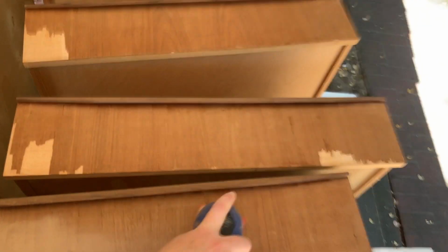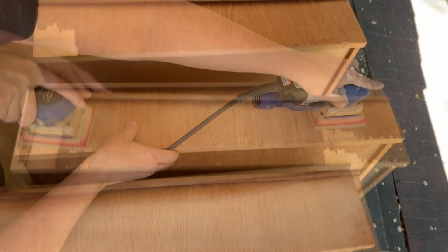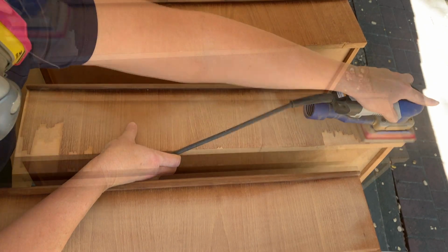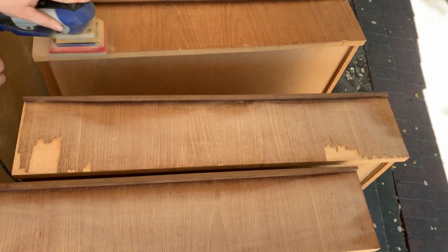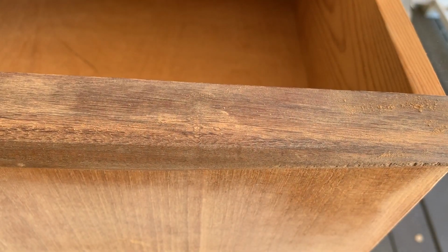So next I took out the bottom 4 drawers again and gave them a good sanding, both to prep the surface and to locate and knock off any remaining loose veneer. And then I started to sand the pulls. It almost looked like wax or some other sticky liquid had dripped onto the pulls, and they were also moderately scuffed and dinged. But when all that gunk and the old stain came off, underneath was gorgeous natural teak.